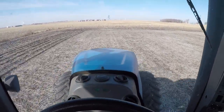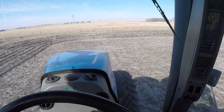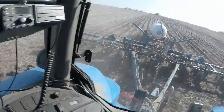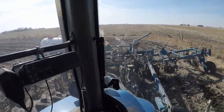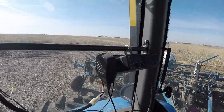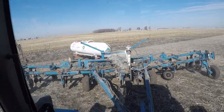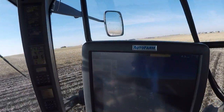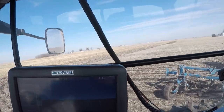Coming up on the end here, so I'm going to see if I can do this one-handed. I'm coming up to the end, I'm going to disable the auto steer, and then shift down a couple gears. I'm going to lift the pump, and then lift the toolbar. Even one-handed I managed to not hit the fence, so that's good. Now we're going to get turned around and squared up. It's pretty hard to back up with these tanks because you have the toolbar in between, so normally try to pick a spot where you don't have to back up if at all possible.